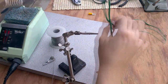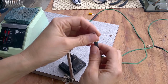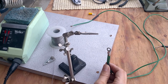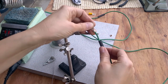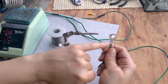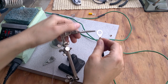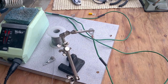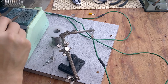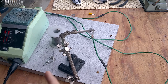I'm building a ground wire here — it's a bit funny because it has two wires on one side and two ground straps to go to the machine frame on the other side. I just want the machine frame grounded. The safety bonus is it's grounded, but the drawback is that if you drop a hot wire on it it will spark. I crimp, solder, and add heat-shrink to these connectors. I tried the crimper the other way and it didn't do as well. I use the alligator clip heat sink because it doesn't melt, and I try to remember to put the heat-shrink tubing on first — I've forgotten it before.